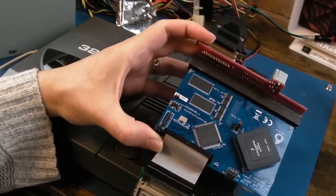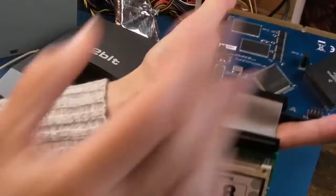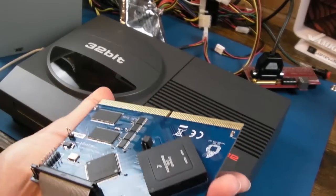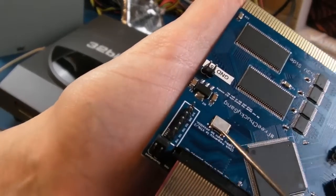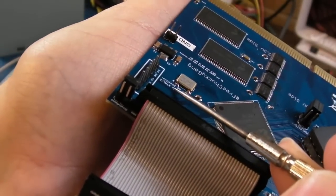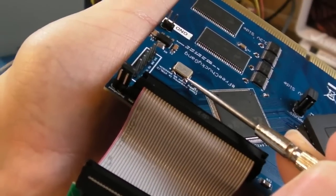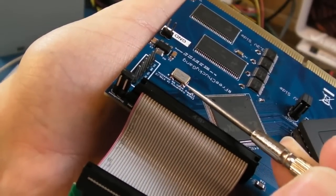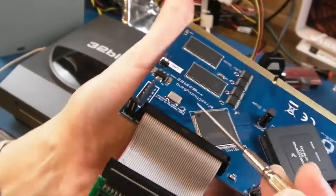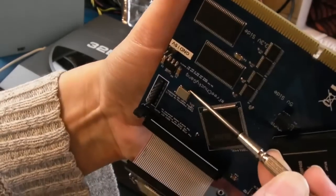Then I looked at the crystal here. You are not going to be able to see this now because I have just fixed it, and this was the issue with my 330 here. So it had nothing to do with the recap work. On this crystal, which is a 4-pin chip, the solder points should go up over the gold points you can usually see on the sides, on all four sides. The way it was, you could see gold up the side, gold up the side, gold up the side, gold up the side.